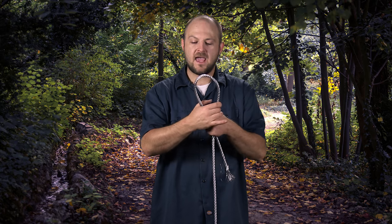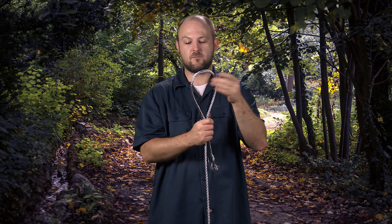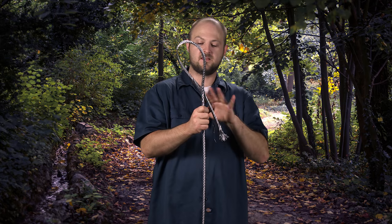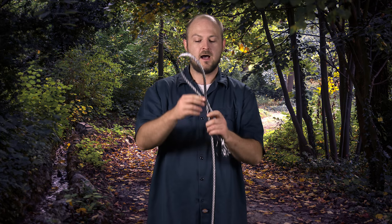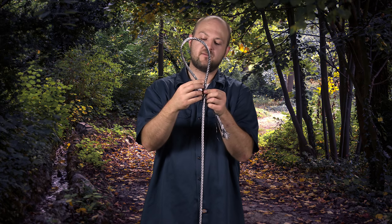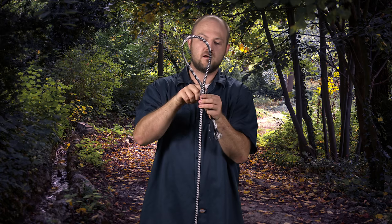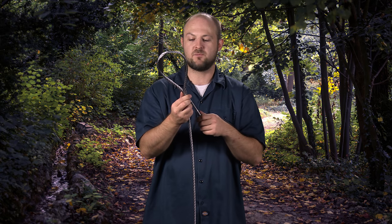So you want to try to keep the eye as small as possible while keeping at least a six inch tail. That'll give you the most strength to the overall cable. If you have a bigger eye it's going to be a little bit weaker, but I did this large so that you guys can see the example a lot easier. And you want to get this area in here to be as tightly wound into itself as you possibly can — that's a point of failure so we don't want that to fail by having it loose. Make it as strong as possible.